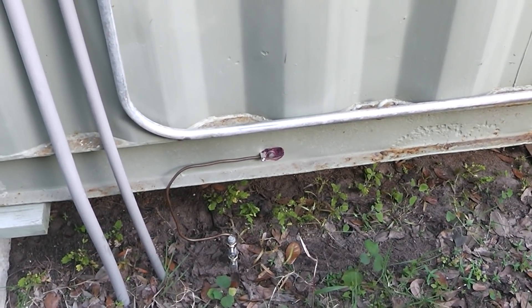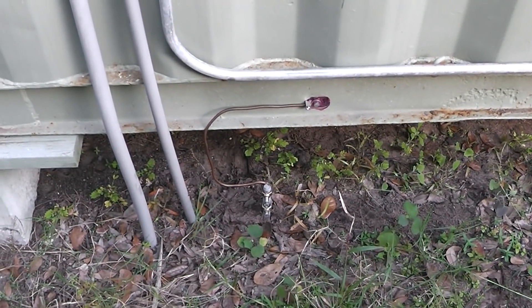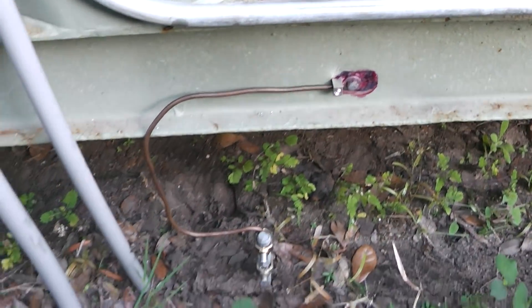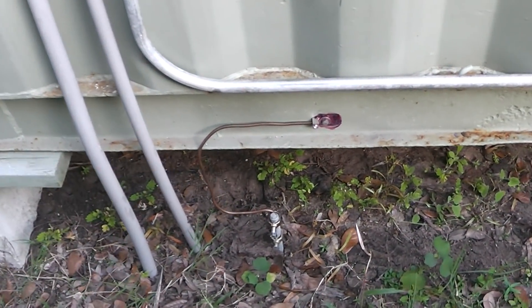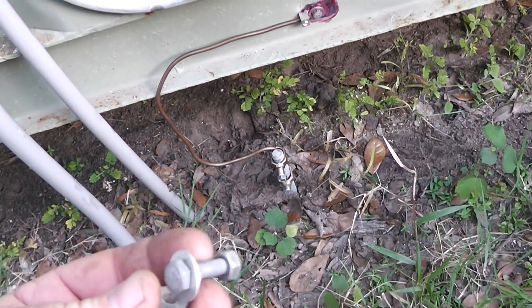The reasoning is that the grounding wire acts as an antenna. Anyway, you can see how this is grounded — that's grease around there so it doesn't corrode. I just drilled a quarter-inch hole right through and scraped the paint off so I'd have good conductivity.